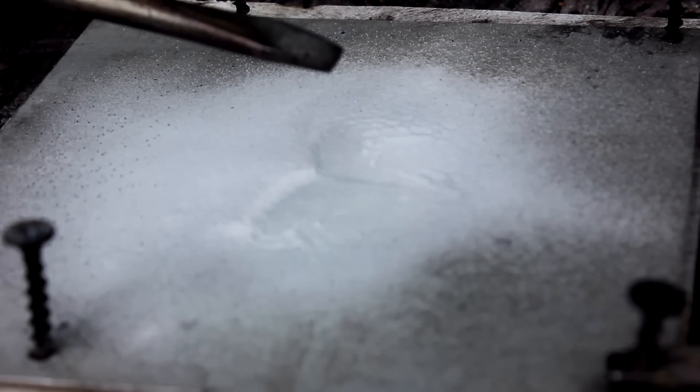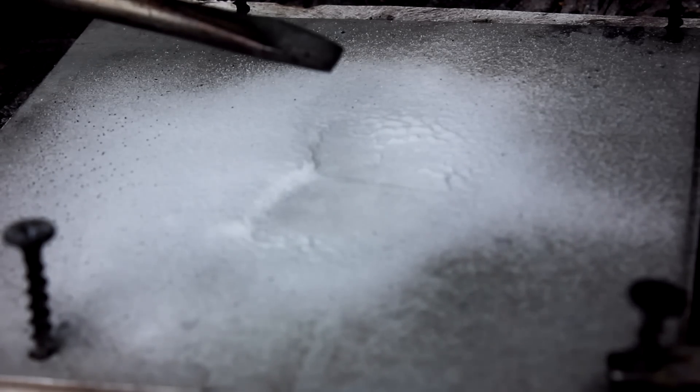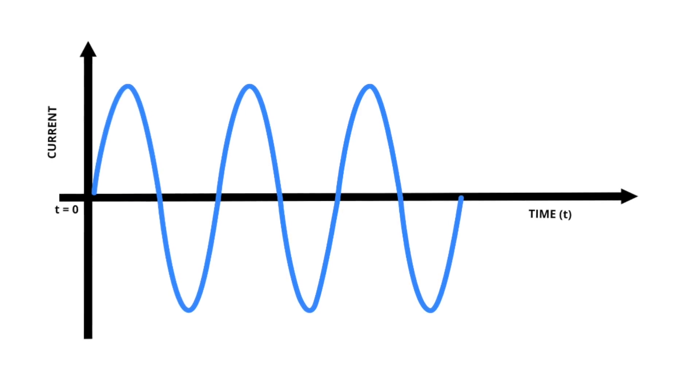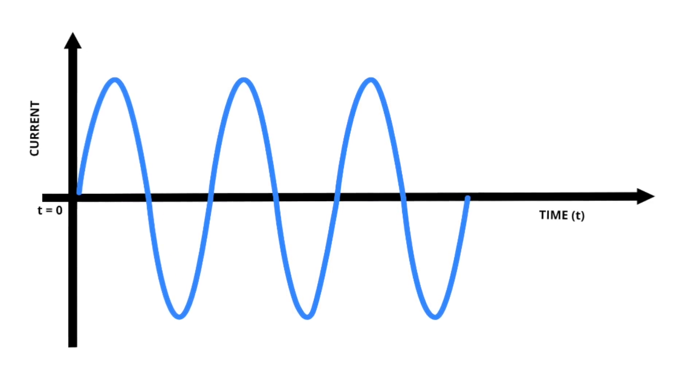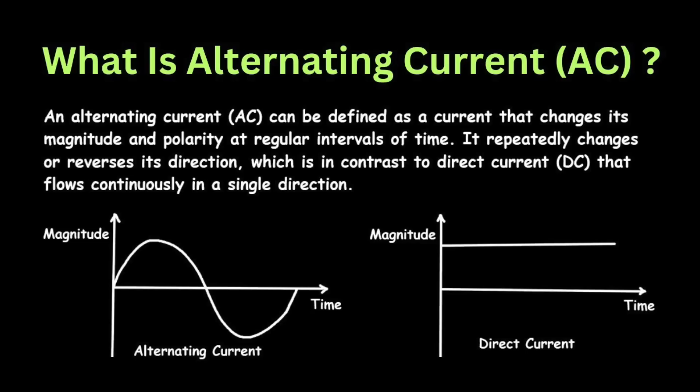If the powered lead has multiple sharp points or corners — like if you use a flathead screwdriver attached to your lead — the electricity will jump from all sharp points. This creates two mobile electric fields which, in the presence of baking soda, will throw out or erode the soda in two fairly distinct lobe shapes separated by a chevron. I've noticed that the corona discharges coming off the tip of the electrode are always in pairs, even if the tip is sharpened to a fine point — not surprising since our transformer is AC, producing an oscillating current flow that periodically changes direction.